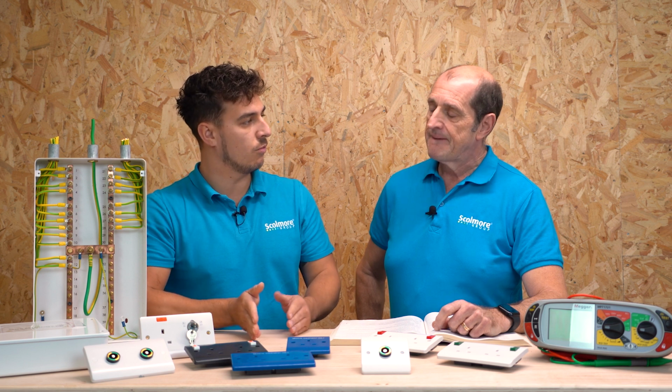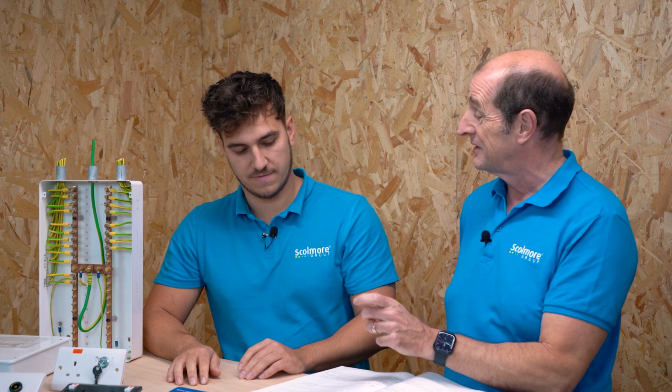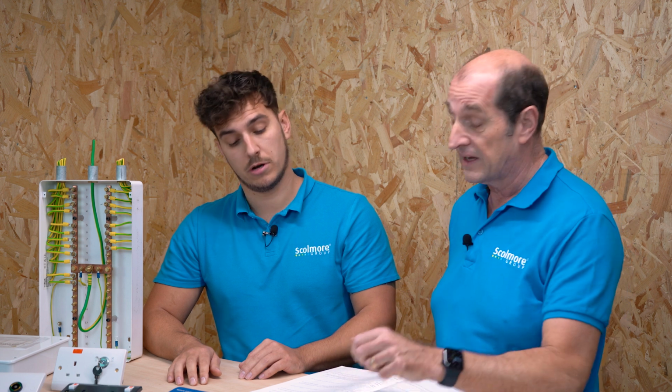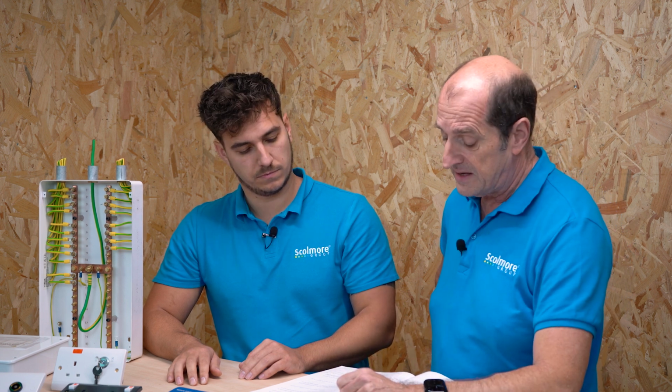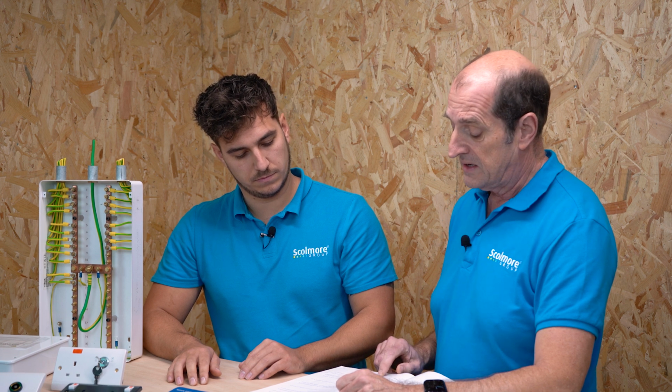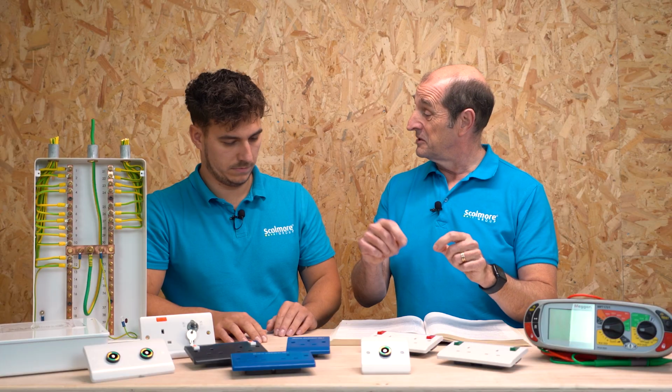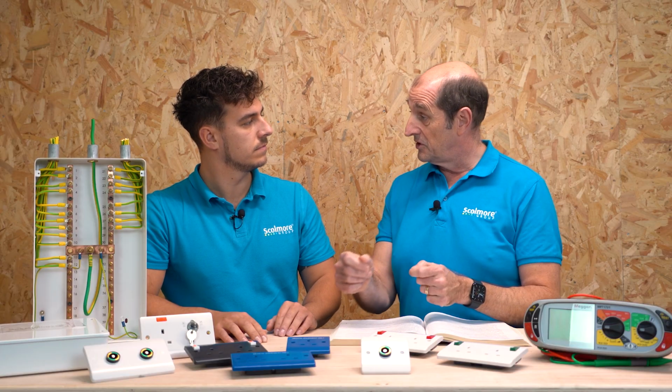So when we start to look at the initial verification of this, do these need to be recorded? And if they do, where do they need to be kept? Well, there is a requirement in Regulation 710.641, which is peculiar because it sits outside of the normal Chapter 64, where we expect to see all the testing requirements. But here it's very specific, and I think it's the only special location where additional tests are highlighted. It says measurements to verify that the resistance of the supplementary equipotential bonding is within the limits stipulated by the regulation we quoted before. So not only do you put in the equipotential bonding, you then have to confirm that the 0.2 ohm value is not exceeded.